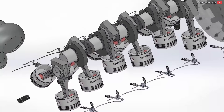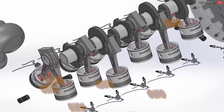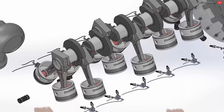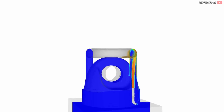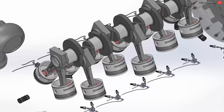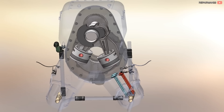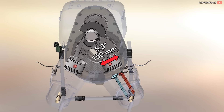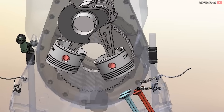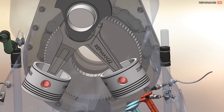When inverted, the oil fell and remained on the underside of the pistons, which were removed when they moved back. This ensured that a large amount of oil touched the pistons, cooling them — the equivalent of using oil injectors under the pistons as used in cars today. The pistons are made of light alloy. Since they were upside down and had a diameter of 150mm and a stroke of 160mm, they had to use a large number of rings — in total five, three for compression and two oil scrapers.